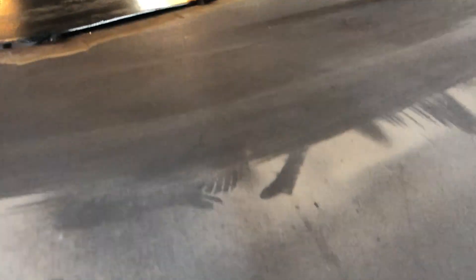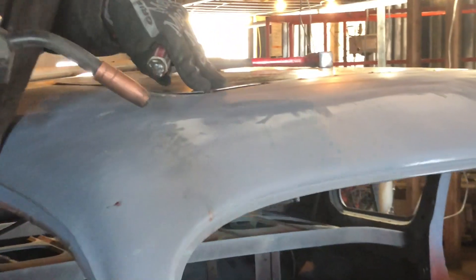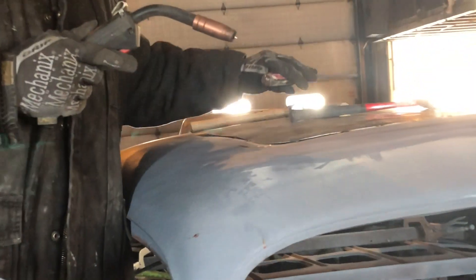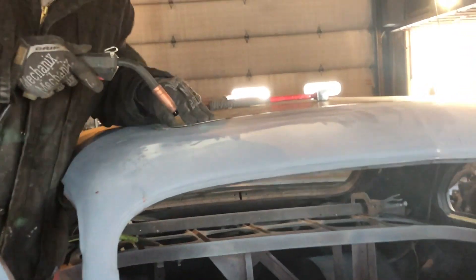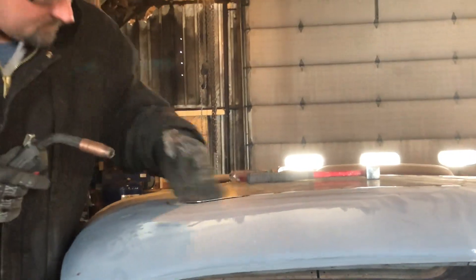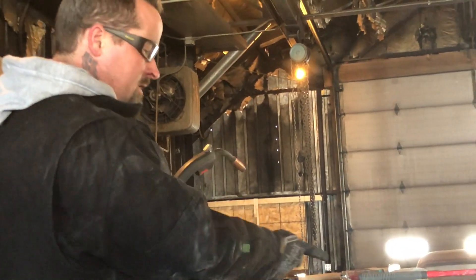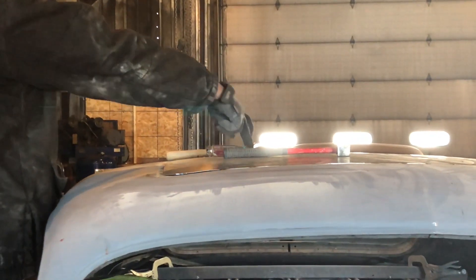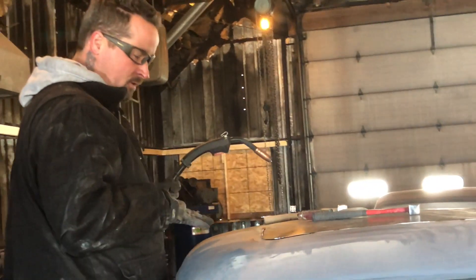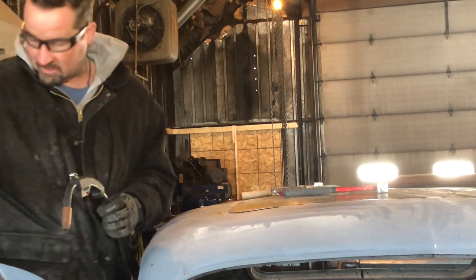My assistant's a lot better looking than Spud — my gorgeous assistant. All right, well I got to grind that one down. But you can kind of see what we're doing. By doing this side, it brought this one down too — flowed the whole panel into the roof, and now everything is going to go like that. It'll have a nice crown and look awesome.